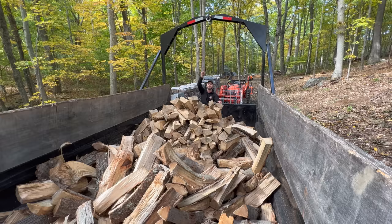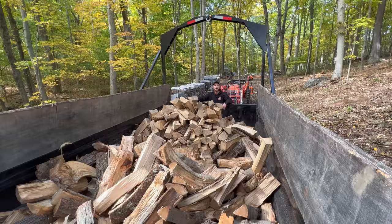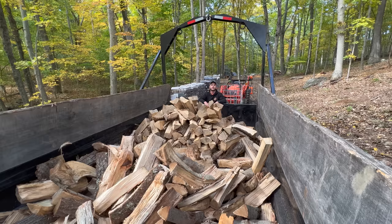Also, with the added height of this dump trailer, my SureTrack dump trailer, the deck height is roughly about 29 inches if it's on level ground, which essentially takes away 29 inches of my lifting capabilities. I find it's a little bit easier to load the firewood into the dumpster can of the International Hook Lift truck, just because that sits about 6 inches up off the ground. So I gain essentially that 23 inches of height that I otherwise would lose